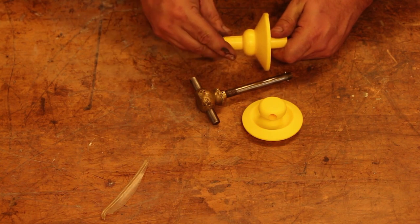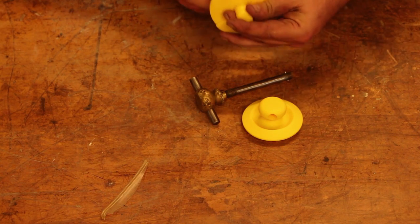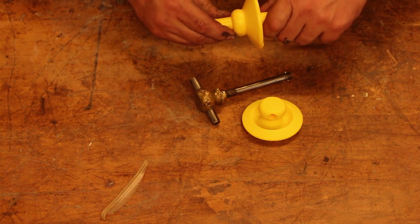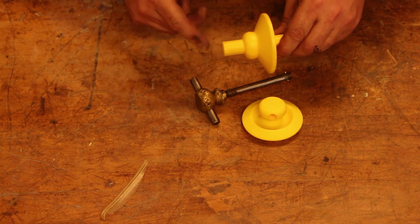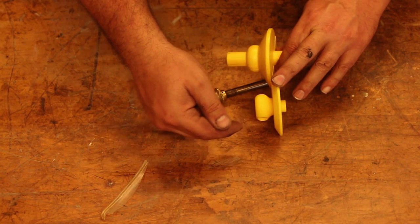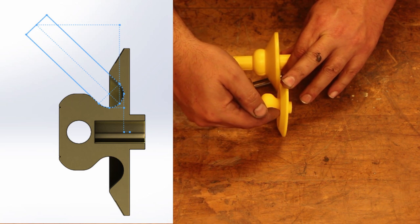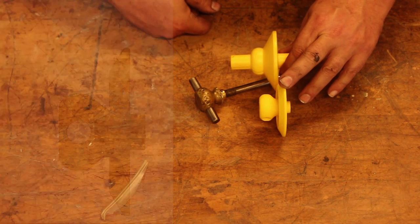But we'll start by gripping on this side. We'll clean up the back side, leave enough for me to grip, and then we'll flip it around this way, running true to that side that I just machined, and I'll machine out the profile. And to do this little back cut in here, it's actually just a 1/2-inch radius cutter that's going to come in here at a 45-degree angle. It'll come right in here, and that's going to create that little cavity in there, which looks like the way they made the original ones.